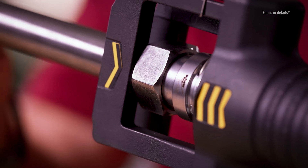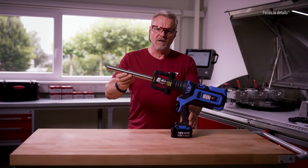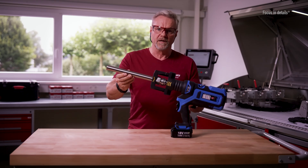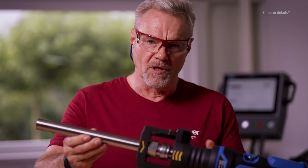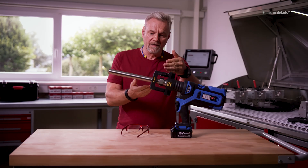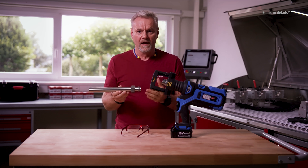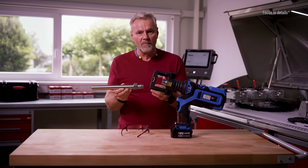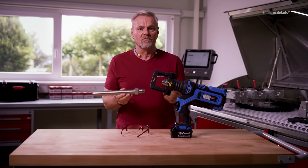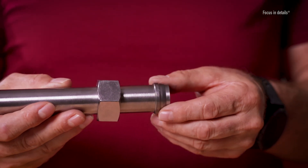The pressure is built up hydraulically by the lower switch and remains depressed until the end position is reached. The machine switches off and the green LED flashes three times. To release the pressure and return the piston to its starting position, the upper switch must be pressed past the pressure point. By opening the retaining clamps, the tube with a pre-assembled cutting ring can now be removed. A visual check of the pre-assembled cutting ring is the last step in the pre-assembly process. It must be able to rotate radially but not move axially.